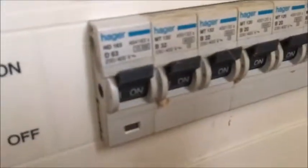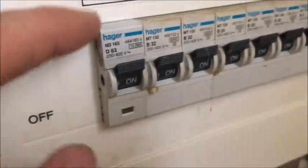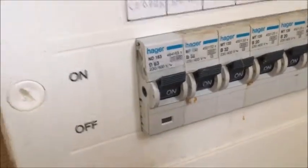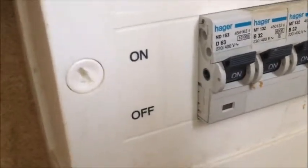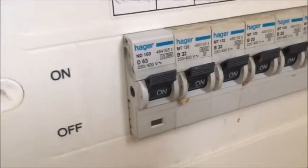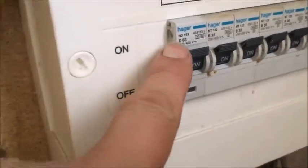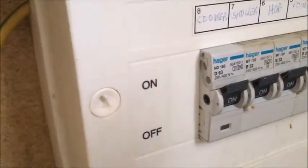The only one I could find in my box was a D63, which is for inrush currents. A D breaker at 63 works — you might even get away with 32, 40, or something lower. The only one I had was 63 and that works for definite. You can buy them for five quid. If your welder is switching off every time, it's because of the inrush currents — buy a Type D breaker, which can handle up to ten times the rated current, so 630 amps inrush.